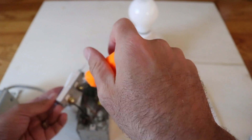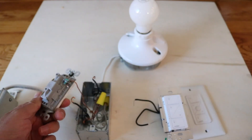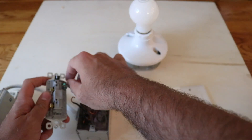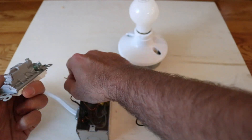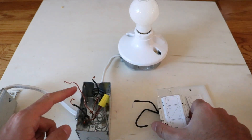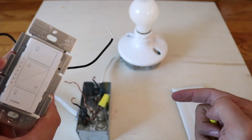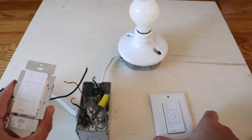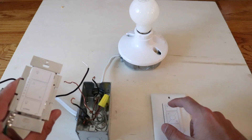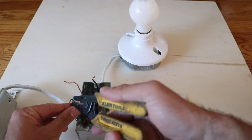What is nice about these three-way switches is that it really doesn't matter which wire — hot or load — goes where. They will work even if you wire them backwards; there is no backwards. We've got the ground wire — let's handle that out. So we've got our ground wire, our load, and our hot wire. This does not require a neutral wire — this three-way switch does not, I repeat, require a neutral wire, which makes this super easy. This Lutron three-way system is used in a lot of commercial buildings and high-end homes. This is what a lot of custom builders use because it is so simple to install, and because it doesn't require neutral, it does save them some amount of time.